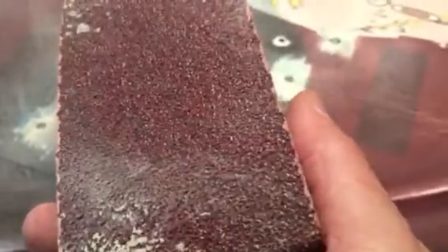For the sake of time, I went ahead and sanded these. Here's what I used: a block with 36 grit. Fiberglass is pretty tough and really takes a while. I just kept the block flat. Anytime you've got a flat surface, use a block — it keeps everything flat and true.